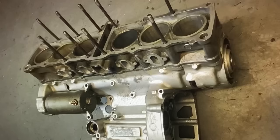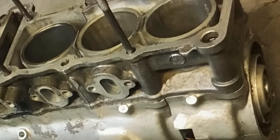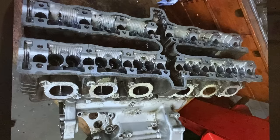In this picture, you can see the barrels resting onto the bottom crankcases with the additional parts not welded yet, and the joins are staggered, so it's cut between the end cylinder on the crankcase, but the second cylinder in on the barrel, then back to the end cylinder on the cylinder head to make sure you've got a stepped joint. With the cylinder head parts machined, they rest down onto the barrels nicely, and you can see the joint here across the journals.